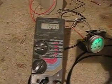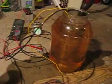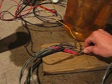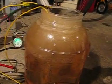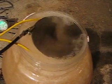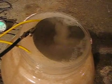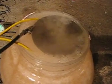We've got a charge of about 7 volts from previous testing, and the amp meter is at nothing right now. I'm about to plug it in. Okay, immediately we get some action in the cell — quite a nice reaction. I've previously tested this. The three bottom cups have holes drilled in them; the top two don't. I'll drill holes in them later to let some water flow, but right now I think we're doing pretty good. The amp meter shows about 30 amps.